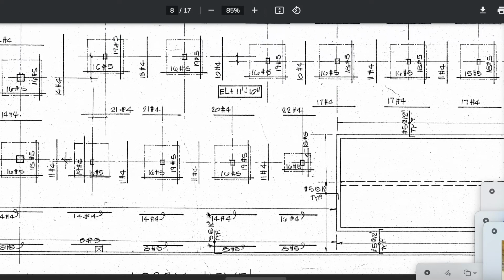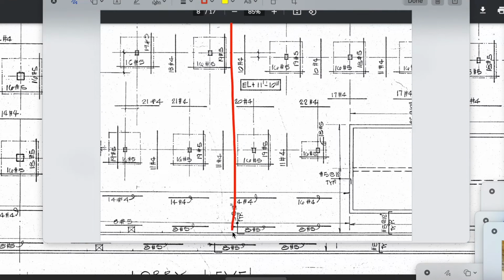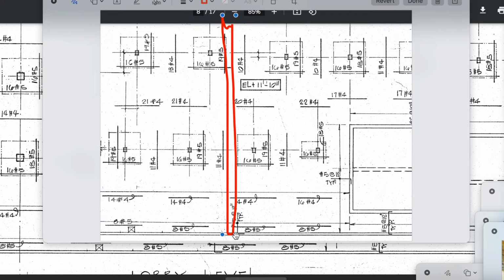I want you to imagine the section. When you section this, I'm going to do an air ball on purpose here. Okay, so let's do that. So there's a section, let's call it 13 inches wide or 12, whatever you're happy with. You can see I make it from the wall to the wall. I bypass, I miss both of these critical shear zones. See, I'm right between them. Even miss that one. And it continues on. So I miss it. I'm on the outside of it as you run it all the way over. Now, these panels, ACI likes to see them as... the steel is continuous.